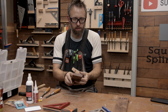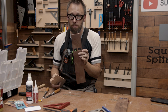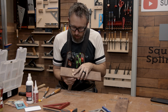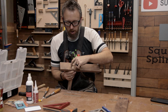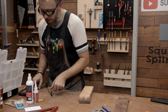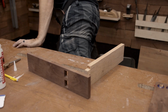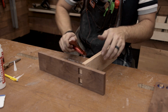So I spent the last little bit, instead of just drilling a round hole, going to the trouble of actually cutting mortises. Cut tenons, this is a new piece. So put that in there, and I cut them a little big on purpose. Accentuate that even a little more. I'm gonna trim these tenons down just a little bit more, try to make this as even as possible around here this time, instead of our other one where it wasn't quite even. I may or may not have been the first person to do this, not that it really matters, other than I might win a couple internet points. Square, square, that's triangle. Odd, huh?